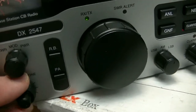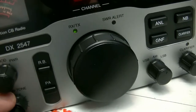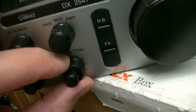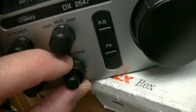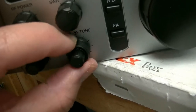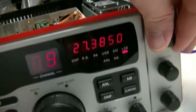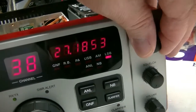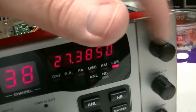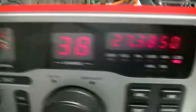I've also made modifications to your radio so you can turn that hash down. Instead of a fixed high cut, I've incorporated the high cut into the tone circuit, so you can set that wherever you want — it's variable, down to super quiet, which is nice. You can turn it up too. You didn't order a kit, so your 9-normal-19 switch still works. Normally I would put the kit right there where that's at. More to come.